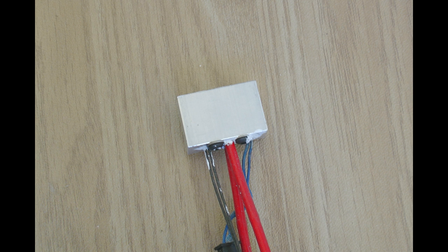Here's a quick picture of what it looked like. Then I hooked it up on my machine — I just disconnected the heater and the temperature sensor and plugged two temperature sensors in. I created another sensor on the Duet board so I could see both on the web interface. That was created as an extra sensor not associated with the heater. I used the PT-1000 associated with the heater, and the thermistor as an extra sensor. I plugged the wires into the Duet board and let the complete assembly hang in free air.